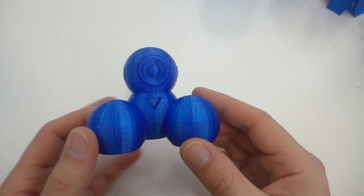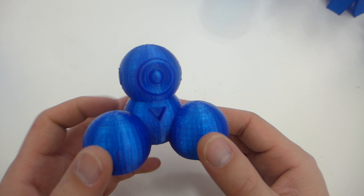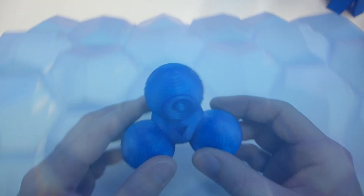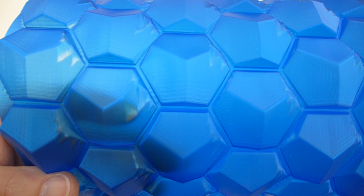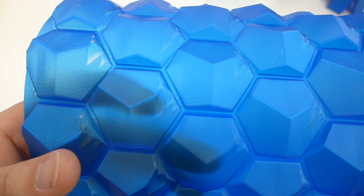15% infill — this took quite a few hours because it prints slow at only 50 millimeters a second, though most of the time you're only printing like 40. Then I printed this giant honeycomb vase: four bottom layers which all came out well, zero infill, no top layers, one perimeter. But it had issues on these extreme overhangs on all of the honeycomb shapes.